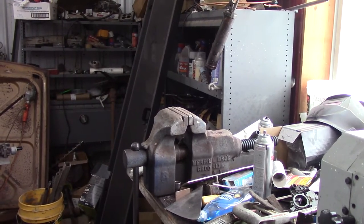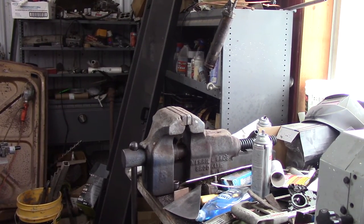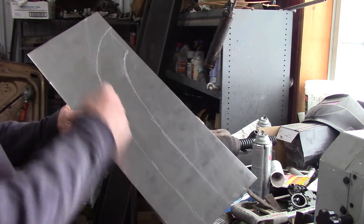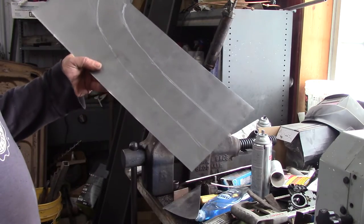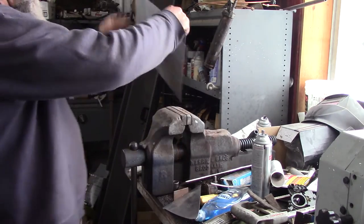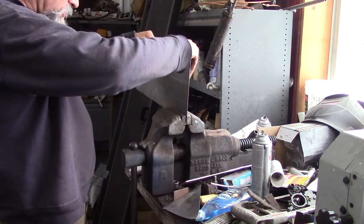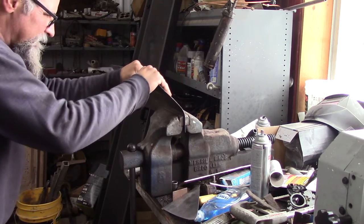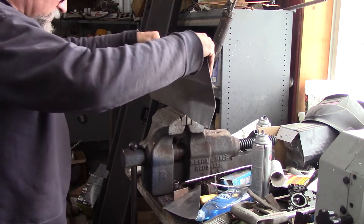So that's kind of my basic profile - then I've got to go about two and a quarter inches up, over and around, and see if I can't pound that one out like I did the other one. Wish me luck. I'm just going to use my big old vice right over here to get my first initial bends. I scribed out and traced out what it's supposed to look like, and I'm just going to drop it in here and do some rough bending.